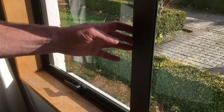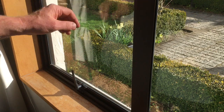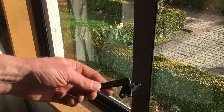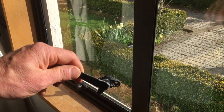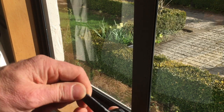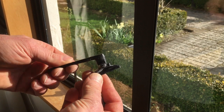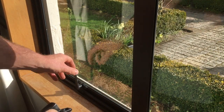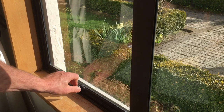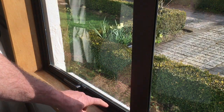This is your typical aluminium window from the 70s or 80s — this one's from the mid 80s, single glazed. These are the original handles; you can see one here. The powder coating's been worn off it and there's quite a lot of movement, so when it pulls shut on the wedge it doesn't pull it right in and you don't get a nice airtight seal. You can see there's a gap here and the window will whistle through it.